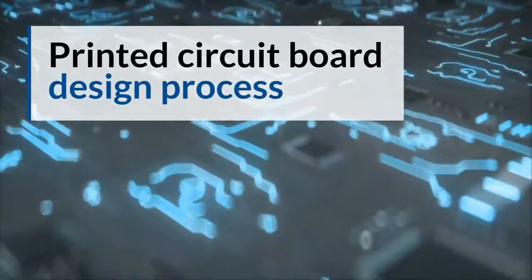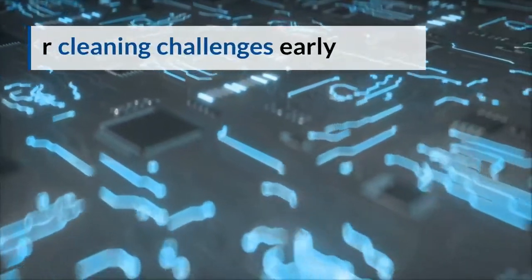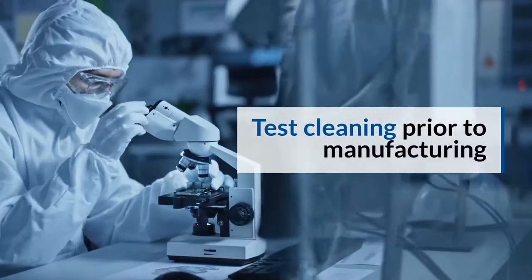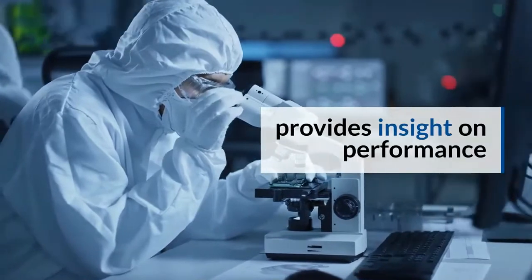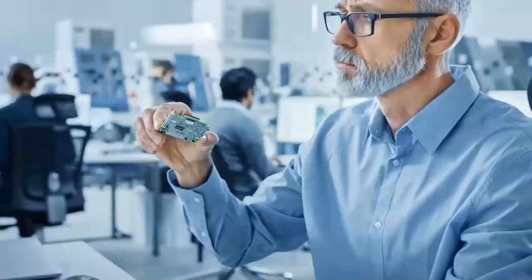Choosing a flux and solder paste early in the printed circuit board design process, only to discover later that they can't be cleaned, is an avoidable problem. So test cleaning small batches prior to full-scale manufacturing gives a designer insight as to how their pastes, fluxes, and cleaners impact the performance of the board.